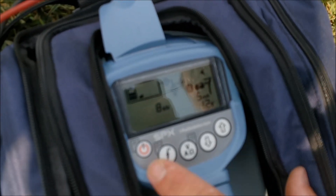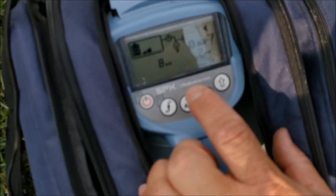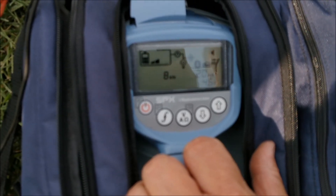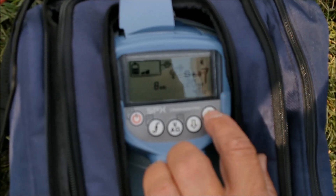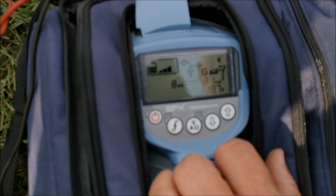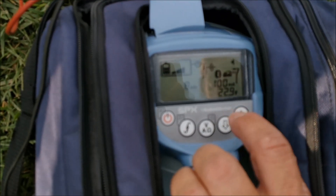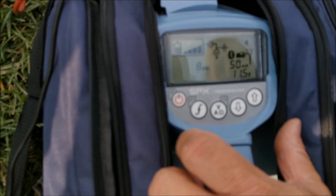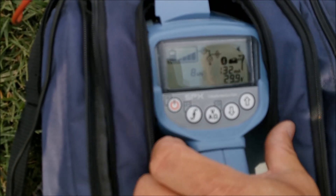If you're on a cast iron pipe, you're going to probably go about 100 feet. I'm going to increase that by hitting the up arrow to two bars — two bars should give you 20 milliamps, which is enough on a tracer wire to go probably a mile. On cast iron, you'll probably go about 300 to 500 feet. If I go to four bars, I will get about 100 milliamps — on tracer wire that should go probably three miles, and on cast iron you should maybe get a block worth of locating done. If I crank it all the way up, it's going to try to go to 500 milliamps, but the resistance of the line and the ground won't allow it to.